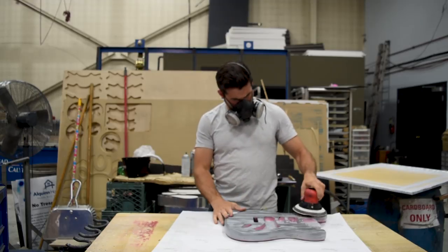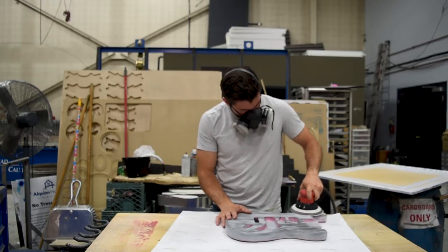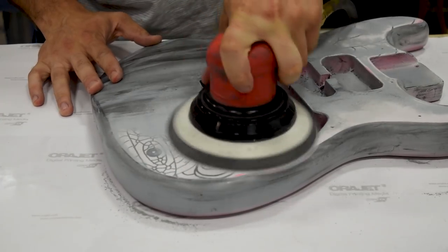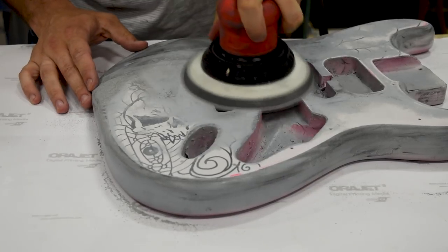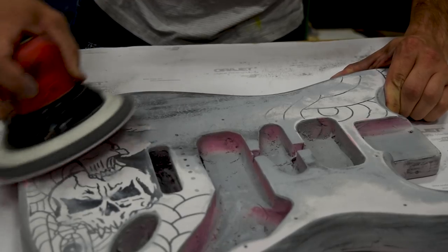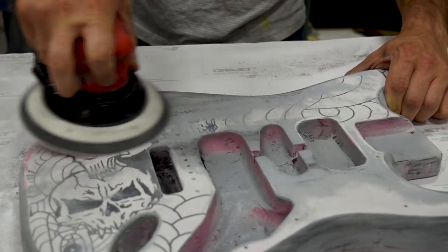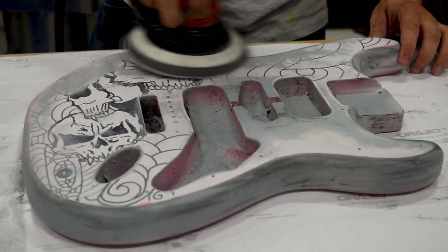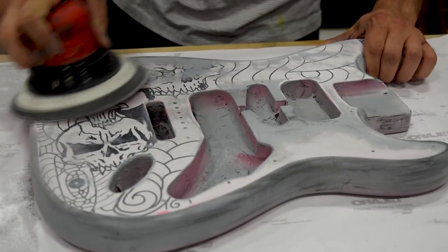So like I said, we've got to take off a few layers of paint here. I'm going in with some 220 grit — I might have started at 150 and then worked my way up, ending up all the way at about 600 grit paper. You can see the old paint jobs underneath coming back as I make my way through these layers. When you're doing a paint job, you don't want more than about two paint jobs' worth of paint on your guitar. After that, you start to run the risk of some product failures, so go ahead and sand back if you're in that situation.